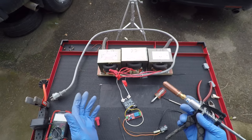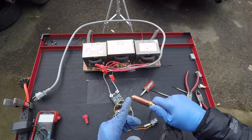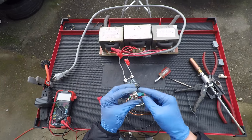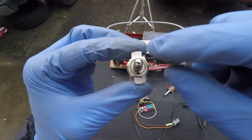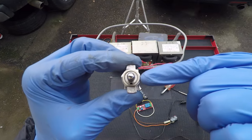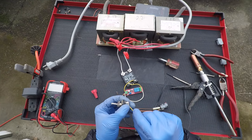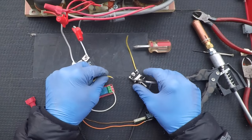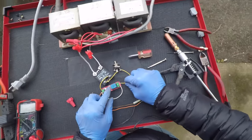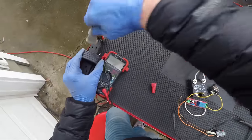I don't want to have to adjust this little knob every time I go between the puller option and the shrinking option, so instead I'm going to wire in a little toggle switch. This toggle switch has three contacts, and if you look in the front it's got on and on positions — if I go down it's on, all the way up it's on, and the center is off. I'll connect a wire to one of the leads on the switch so the wire coming out of the center port goes right to the switch, and then runs back into the center port. Let's plug the transformers back in — no hum, because the toggle is in the center off position.